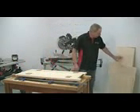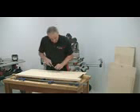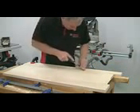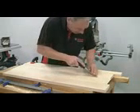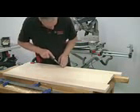We've got the sides, the shelf, the base, and this is the top. You can see now what I meant about the glue squeeze out — it's much easier to let it dry and then you can see it just chisels off. It's much cleaner than trying to get it off with a wet cloth. I'm going to give it all a really good sanding later on. All I want to do now is just get the lumps and bumps off so that it will sit down flat on the saw table when we machine out the sizes. I can assure you it's quicker than trying to sand out glue that's been impregnated into the grain.